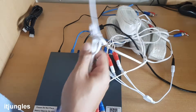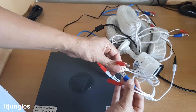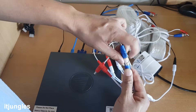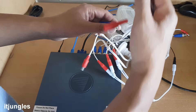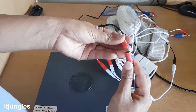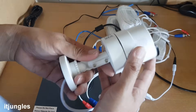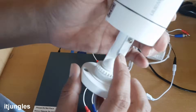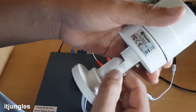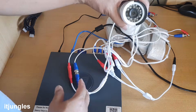On the camera itself, these are the camera cables. Connect the BNC cables to the camera — you can see the pins that you need to line up into the slot, then twist it and it locks into place. The device also comes with an Allen key. Use the Allen key to unscrew the camera mount first before you try to adjust, otherwise you can damage it. Unscrew it first and then adjust the camera direction. Continue to connect all four cameras.